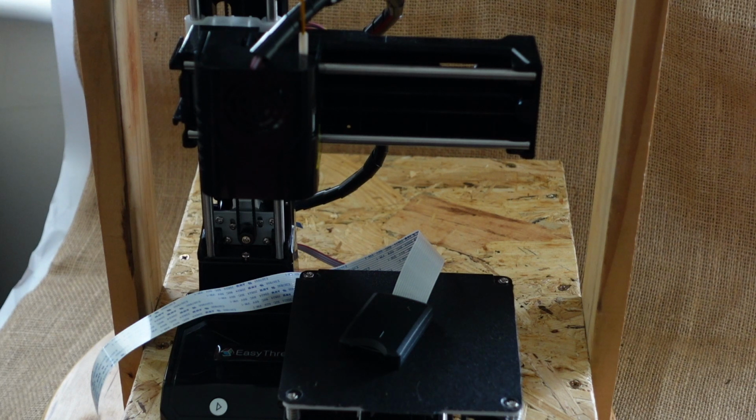You then turn it back to the standard position, wait for the filament to cool, and then I just rub the finger of a gardening glove underneath the nozzle, and that will then clean it off as it's cooling, so that eventually you'll get to a very clean surface. Then you can go ahead and do your leveling.